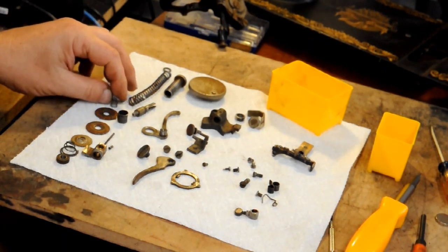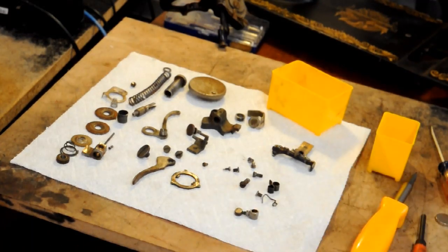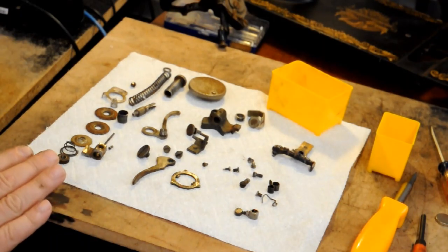I actually bought mine for doing motorcycle parts. I have a couple of 1983 Honda Goldwings, and I had a rear master cylinder that I had to rebuild, and it was filthy, so I bought that little ultrasonic, popped it in there. Took two or three runs to get all that crap off, but she came up sparkling, put a new rebuilding kit in it, and she was great. But anyway, she does work well on sewing machine parts too.